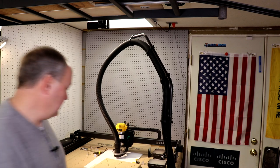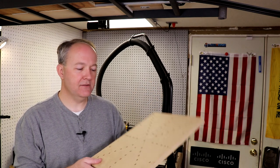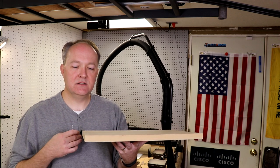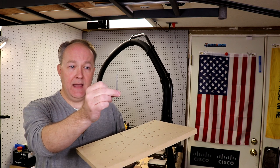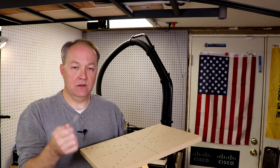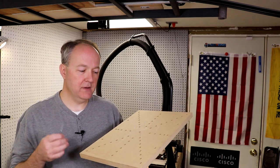I wanted to test the design because the piece of wood I'm going to use to recreate that tray is not going to be plywood like the original. So I wanted to test the code, test the dimensions, and test the fit of the dowels. I basically did a test cut in a piece of probably 20mm MDF and everything worked. One concern I had was that a standard bit is not going to have sufficient depth of cut — 20mm or three-quarters of an inch is typically deeper than most bits I have. So I found a very tiny carbide two-flute one-eighth cutter. The stick-out is not ideal for those depths, but after testing I was able to dial in the sizes.